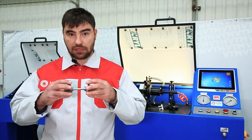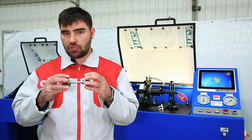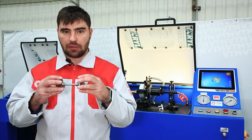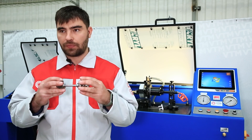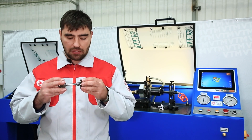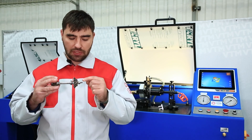When the rotor passes any of the critical speeds, it bends. No one can predict which way it will bend or how much, but its bend is always in the same direction. Therefore, when testing on this stand, we fix the angle at which it deviates and the value, and then by filing the nut, we compensate for this provoker of imbalance.